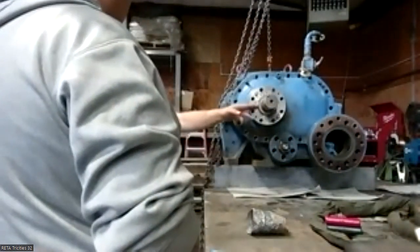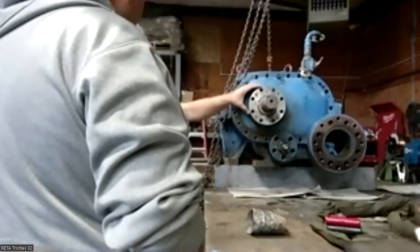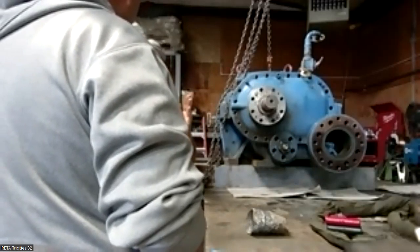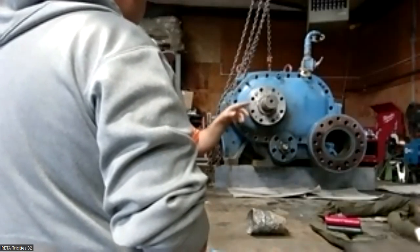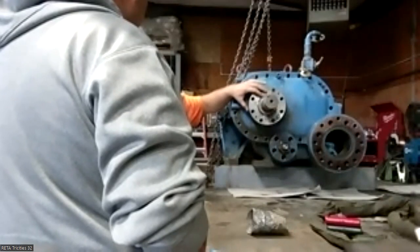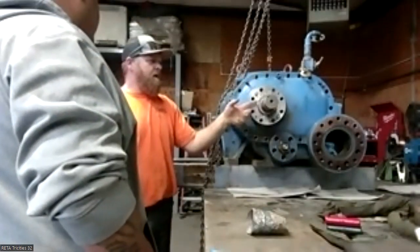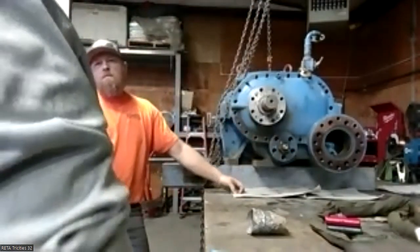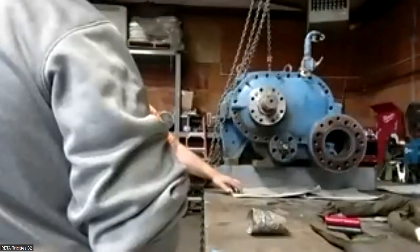What that does is, so this is one complete unit. You know how normally when you push a shaft seal in, you can feel it get tension on it. It's all preset, and that's what this is doing. So that's holding it in place. You tighten the set screws and you pull these out and it holds it there. If you were to take these out right now, that's gonna pop out. Push out. Yeah, and then it's technically messed up. Right. If you got it to seal again, you got it.